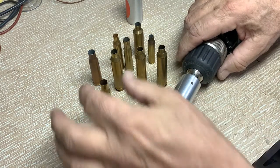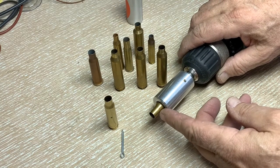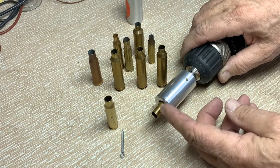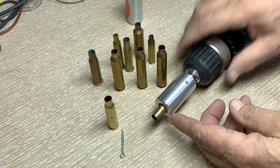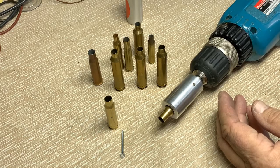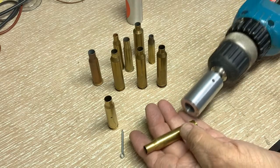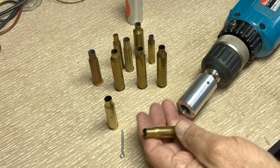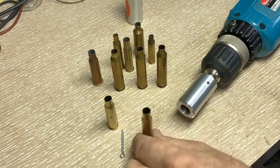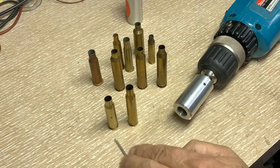A case is put in and heating will start with a propane torch on the neck area and the shoulder area, heated to a dull red only. Then after it's the correct temperature, or seems to be the right color indication, the case is dropped right into cold water which will do the annealing. If you don't know about annealing, I suggest you look it up and find out how copper is actually annealed by quenching.